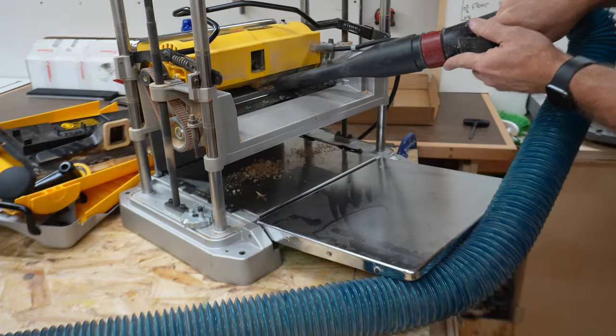So can you see this little groove here? I need a better pointer. If you can see this little groove right in here, just outside the bearing, that's where the snap rings have to seat into, and that way they can't back out. So it's the same on both sides. There's just a little groove right outside where the bearing sits. So the whole assembly needs to be pushed in far enough, but not too far, because the snap rings have to fit on both sides.